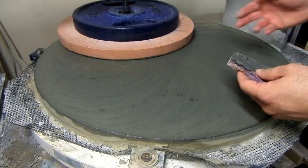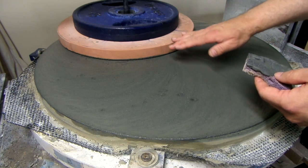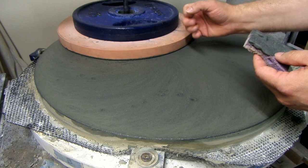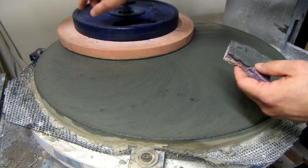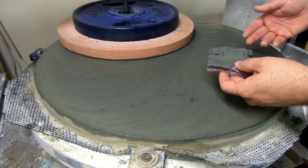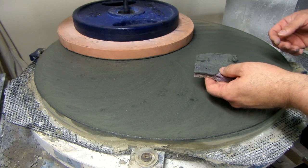That's how I do this grinding. I'll do 20 to 30 minutes, check my progress, clean it off, and make any adjustments necessary. If I find I'm going concave or convex, I move the tool either toward or away from the center — if the mirror is going convex I move it toward the center; if going concave I move it away. Moving it away shifts the mass out and works the edge more, adjusting toward flat. I'll try to get this thing flat to better than a thousandth of an inch and grind the back down to probably 320 or maybe even 25 micron. That's how I'll work flattening the back of this 25-inch F3.1 mirror.